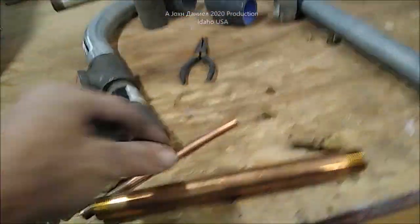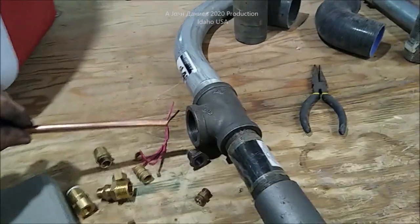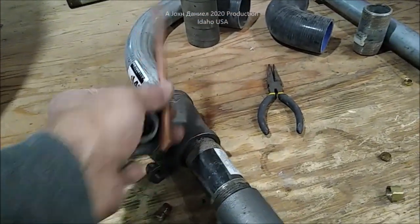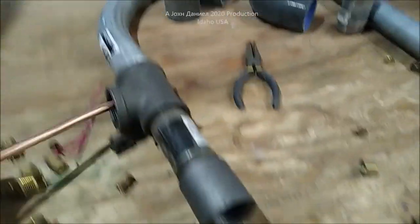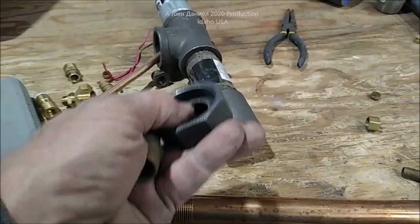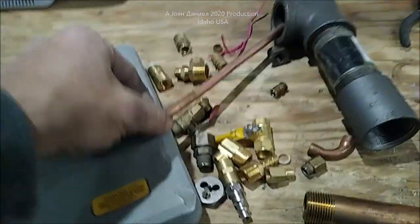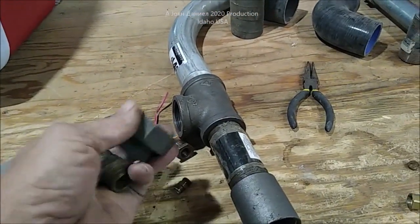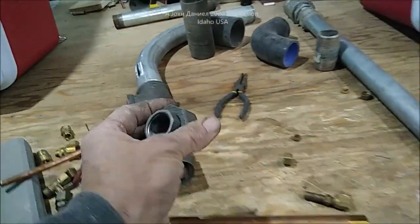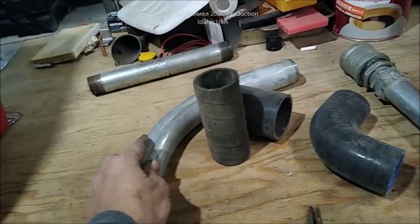The biggest problem you run into making a waste oil heater is having your pipe try to spin. The pipe will be bent into place, sticking up, then coming up through the union just a little bit — enough to get a wrench on it. We'll pre-make the ferrule compressed on it so we basically just have to pull it up and tighten the union down.